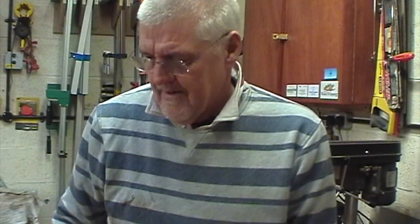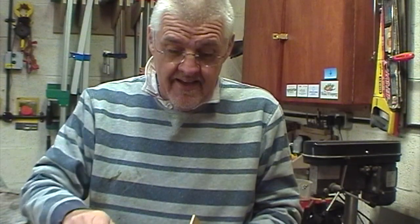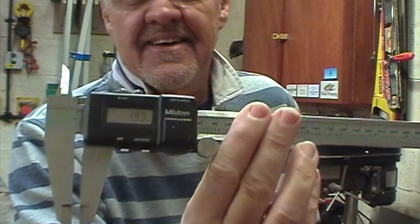But I was trying to wonder why they were as ill-fitting as they were. So I got the ply out I was using, 6mm ply. I don't know if you can see that, it's under 5mm thick. It's funny, isn't it? My fault, I should have checked it before. I'm just assuming when I bought 6mm ply it'd be 6mm. It's not, it's sort of 4.9. Well, carry on.